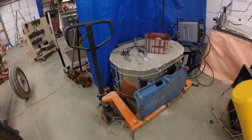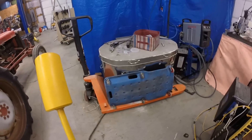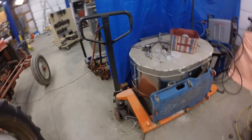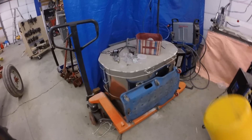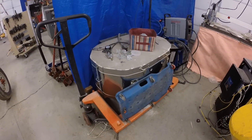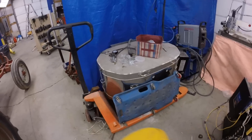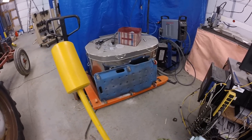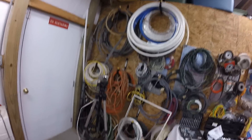Here's a kiln I picked up at auction — I paid $300 for it and it had never been used. The school that bought it had three-phase power and this runs on single phase, so they could never use it. It's like a $3,500 kiln. I'm thinking about using it for heat treating, though it's a bit too big and would cost a lot to run. I might use the controls and elements out of it to build a smaller enclosure for heat treating, because the controls are awesome and programmable.